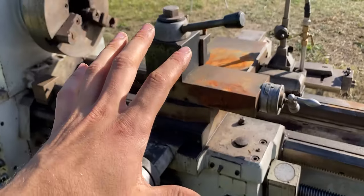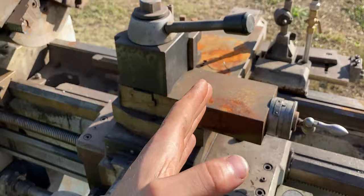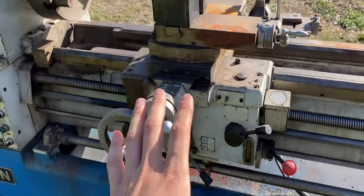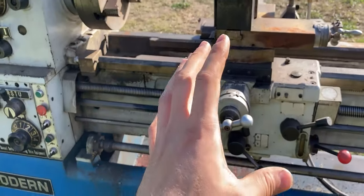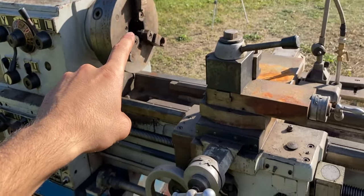In the middle of the machine we have our tool sled. This consists of many different parts: on the top a tool holder, our cross carriage which moves forward and backward, and our main sled which moves left and right. This is the main part to machine anything that rotates over there in your chuck.